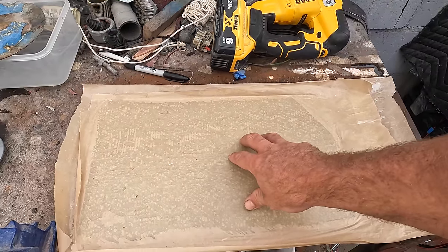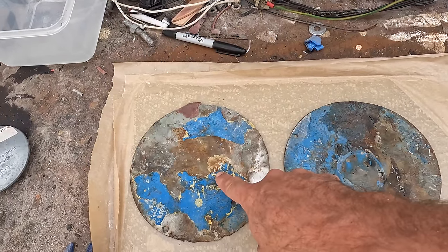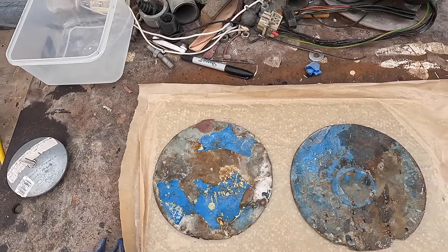There's another marvelous day in the boatyard. It's laid up some fiberglass which you've seen. So we're going to use these — that's all I'm doing, cutting these two out of this. This is just fiberglass epoxy I've laid up here. I'm going to cut these out, barrier coat and anti-foul, and then call it done.